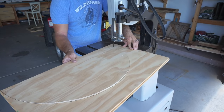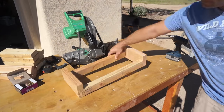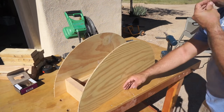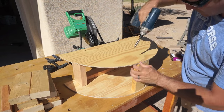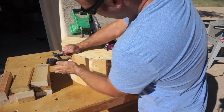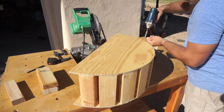The first step is building a curved form to mold the pieces around. I'm using extra plywood I had from my daughter's bed project and some other scraps I had on hand. Once I got my curved shape figured out, I'm just adding some 2x4s and 2x3 scraps to give me something to press the wood into as it's being glued and as the glue is drying.